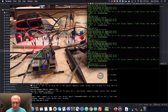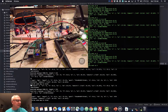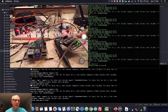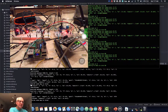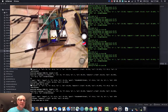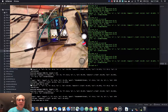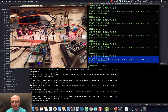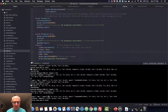On here you can see this guy has a light. Every time, can you see it? It blinks green here. And then here on the display, you probably can't see it. It's a really nice display, I have to say. I really like this. I show just a time and date stamp and some temperature, which I forward to the gateway anyway. You see here I sent this message with ID 7, and here's the gateway. It receives it via LoRa and forwards the message to our cloud.